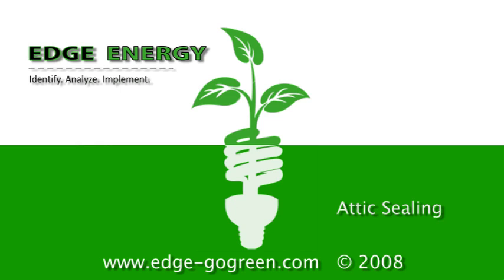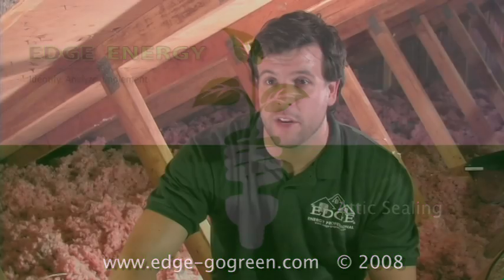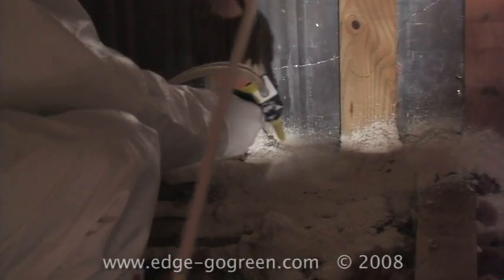And of any energy audits, findings, or information you might get out of them, one of the more important things is to identify air leakage and address it prior to blowing insulation. There's a lot of misinformation out there that insulation by itself can improve energy bills 20 to 30%. That's really not the case unless you've gone underneath and done all the prep work that we've been doing, foam sealing all these air leaks first, because insulation is merely an air filter. It's not an air barrier.